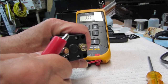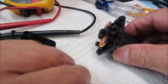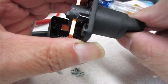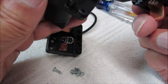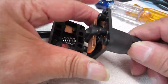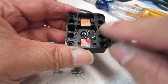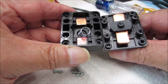We can try taking it apart and see what we find inside. Just four screws. It looks like all we have here is a spring that pushes these contacts together — when you turn this, it's just spring loaded. Let's see if we can figure out why this spring mechanism is not working. Is it just corrosion on this pad? That seems hard to believe. We're going to clean this up and figure out why those contacts are not pressing against the lower contacts.